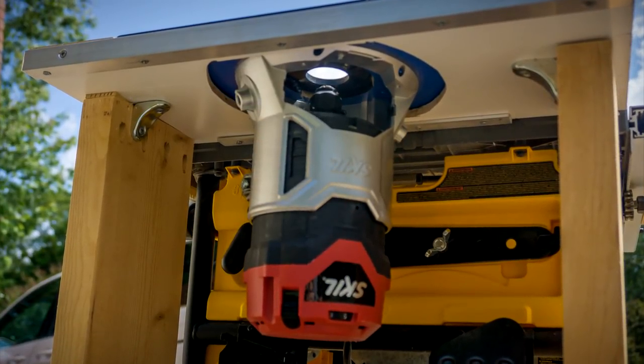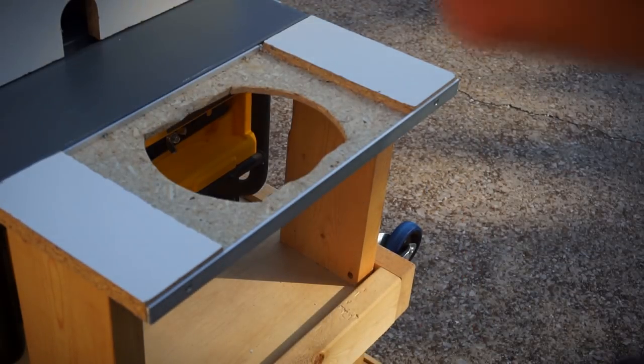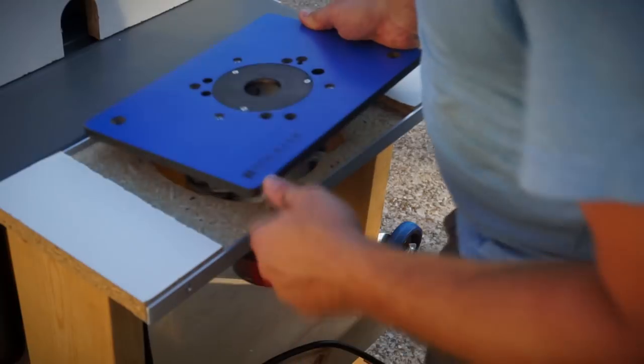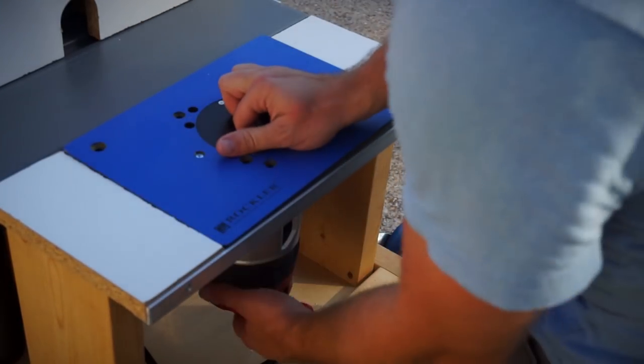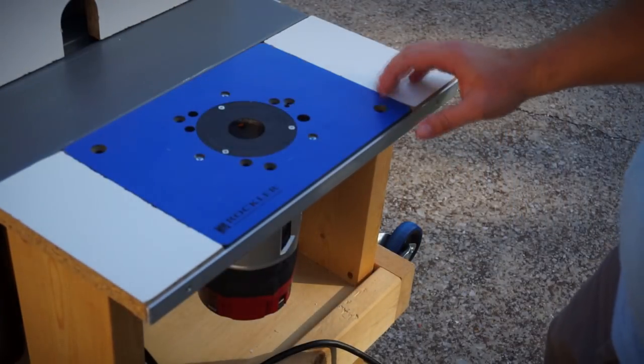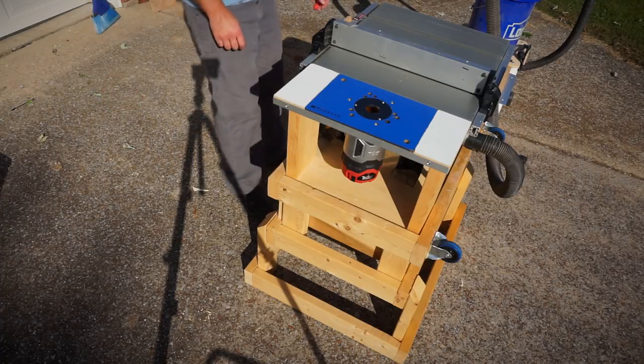You may have wondered what the aluminum angle on the outside is for — it actually holds in the router plate and does an awesome job. You just route down to the exact same size as the router plate and make a cutout that your router can fit through. I use Rockler's phenolic router plate here — it worked awesome for my router. I use router plate B, but they've got a router plate for practically any router on the market. I'll leave a link in the description below.